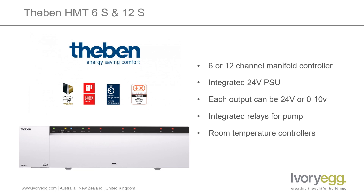It also has separate objects that can be used over the bus to control a boiler or more centrally located pumps. It also has integrated room temperature controllers, which is quite common now on manifold controllers. It can receive the demand from a separate room temperature controller, or it can just receive the room temperature, use its internal regulation to determine the position of the valve, and also provide a cooling function off to a separate controller as well.